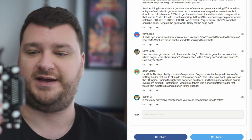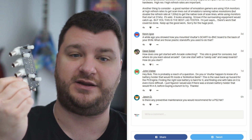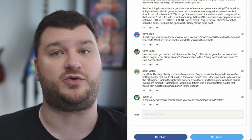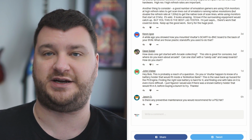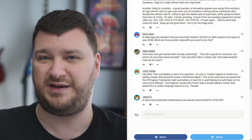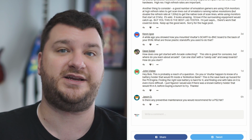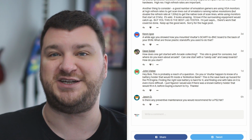Love these things. The only thing I found too is I wanted this one on my second RGB input on my BVM D32, and I found some cheap BNC cables that worked great. But just like those cheap RCA to BNC connectors, sometimes if you wiggle it, you see the signal kind of get messed up. So I asked Steve from HD Retrovision, and he gave me a link to these really high-end single BNC cables, and they were like $20 each.